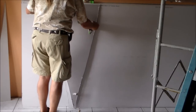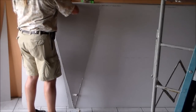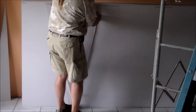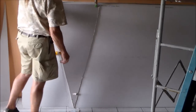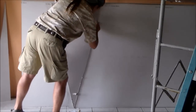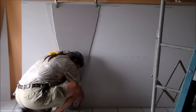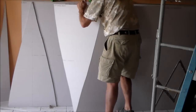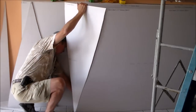When I'm using this first pattern sheet, I'm using spring clip clamps to hold the sheet onto the one that I'm going to cut. When you snap the drywall, you can't hinge this all the way back, or it will rip the paper off of the back of the plaster.